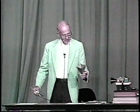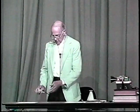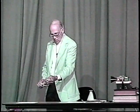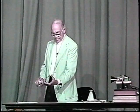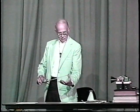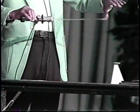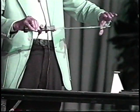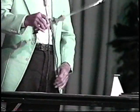This horn — we can see that we have an increase in effective aperture over this little one. But here, we've actually got a physical aperture that's very small; it's just the cross-section of that rod. Yet the effective collecting aperture, the A sub E for this, would be something about this big probably, which means that this rod acts like a lens. The wave coming in gets pulled down, sucked in. This is an elongated lens.